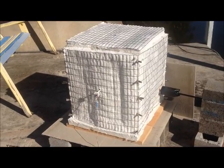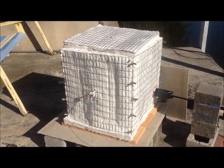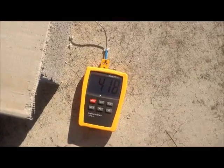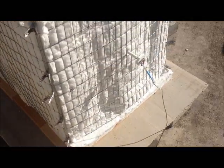It's 10:07 a.m. now. Temperature's up to 412 degrees Fahrenheit. The wind shifted from the east to the northeast and started to blow my flame around a little bit. Since I've got the flame set so low at this point, the temperature started to drop down to about 388 degrees. So I set this little piece of Durock up to act as a windshield. That seems to have solved the problem. We're up to about 418 degrees Fahrenheit and everything is looking good.